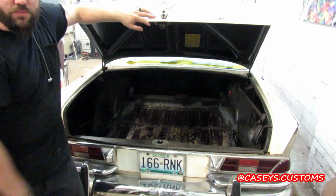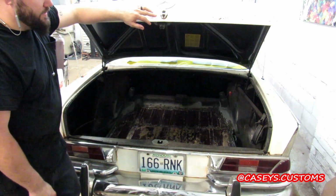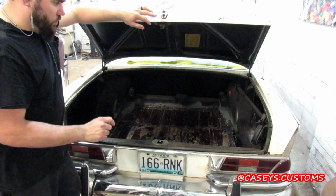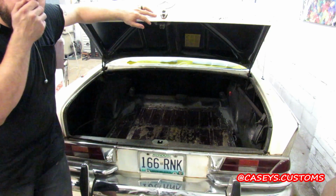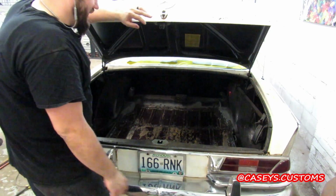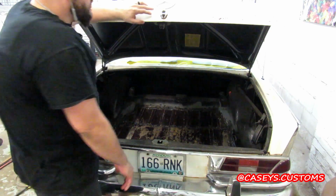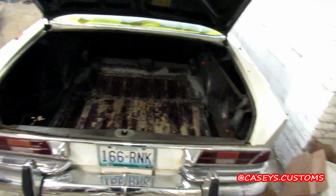I was sitting in it doing my welding, so for what it is, it's a nice little way to do that. The only thing I didn't like was it has galvanized coating on it, so you have to make sure you got plenty of air moving around. You got to have a mask on, which I hate, but it's done. It's welded in. I welded it and bolted it, so I am stoked, and this job is done and getting the hell out of here.